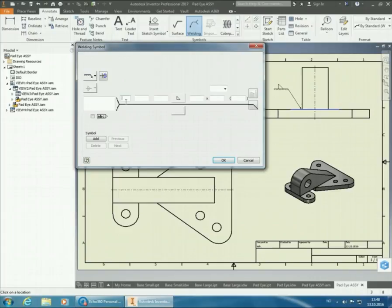This is something that Torbjørn is going to go more into detail with you when you start calculating welds, because that's the thickness of the weld that we use when we are calculating it. But that's just basically to get you to understand why we are going to write an A in here. And in this case, we're going to use a 3 millimeter thickness. So in the next one, we put in a 3, which means that the thickness of our weld is going to be A3.